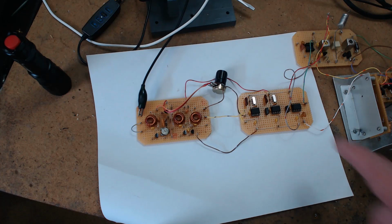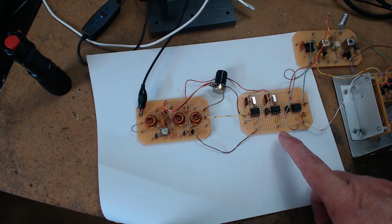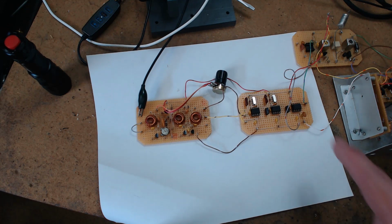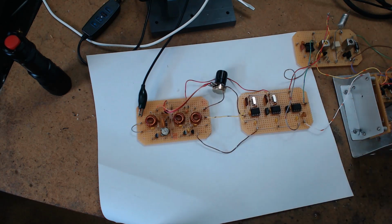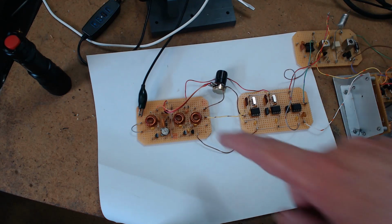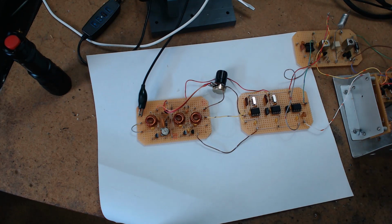But I wanted to show you, I did redo my mixer board. I took it to the next level. There's 3 mixers on there. There's 3 NE602s. You won't find that anywhere on the internet. And then this is basically a Collins circuit modernized. And this is a real front end versus the Racal. The Racal's got some really hefty bandpass filters.